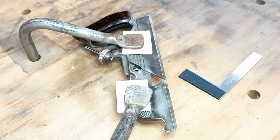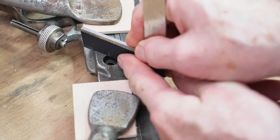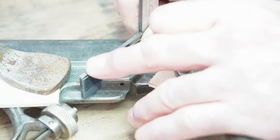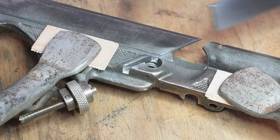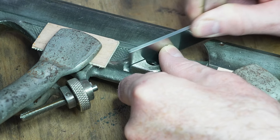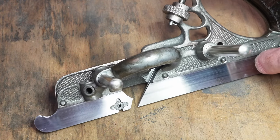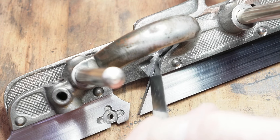Clamping for a while helps get good even adhesion. This is my clamping setup to do the work. The bosses around the holes for the rods are quite robust but I still used only just enough pressure initially. The tool was a tighter fit than expected but after a while it dropped in nicely. There's quite a lot of work to do here — I'm trying to bring the cutter bed down co-planar with its counterpart on the sliding section. I had paper on both sides initially just to get down to the side wall, but once that was done a narrow strip on one side only was sufficient. Every so often I'd check progress by matching up the sliding section, but eventually I realized I'd achieved co-planar at the tips — but in the center I was just flogging a dead horse.